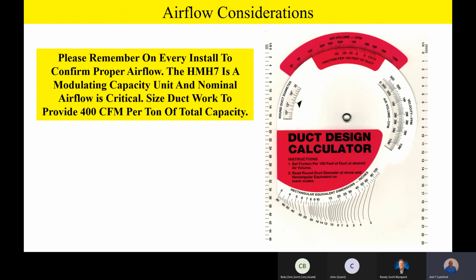It's looking at liquid line temperatures, looking at outdoor temperatures, taking all those temperatures, and it's plotting its capacity. So let's say, for instance, we had lousy airflow inside, the suction line temperature is going to go down as the superheat starts falling, and the outdoor unit will interpret that as a reduction in capacity. So it's going to start screwing back. And so literally on this unit here, if you have poor airflow, you might have a 3-ton unit sitting outside, but if you have poor airflow, it may never go beyond about 2.5 tons of capacity, we'll say.